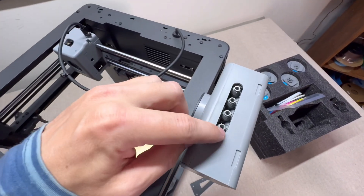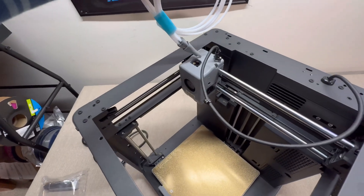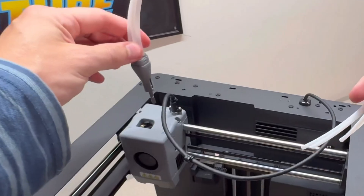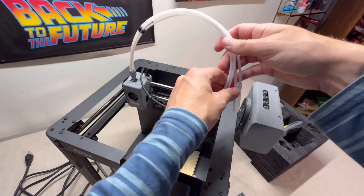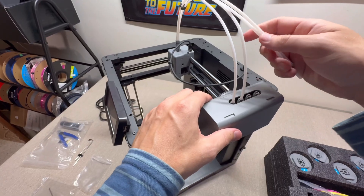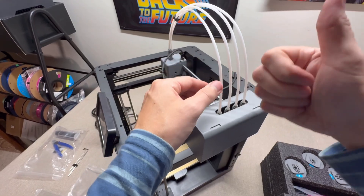Step number four: we're going to connect the PTFE tubes to the head. Go to your accessory kit and find the PTFE tube with the hub on the end. One end goes into the 3D printer head and the other goes into the PTFE hub unit we just installed. After getting the tubes loose from the tape, press the hub end into the 3D printer head on the left — press it down firmly and you'll feel it click in. Then push the PTFE tubes inside of the PTFE connectors and they'll just click shut. They stay clicked shut and do not remove themselves.